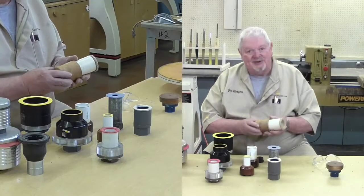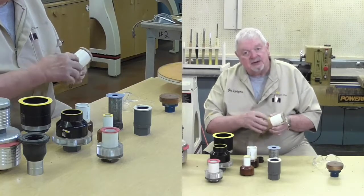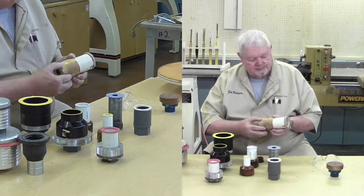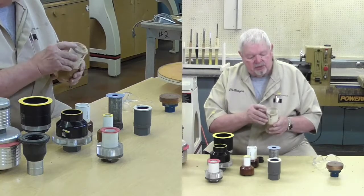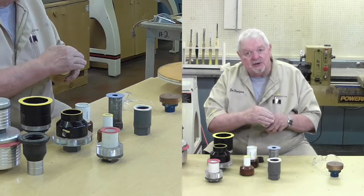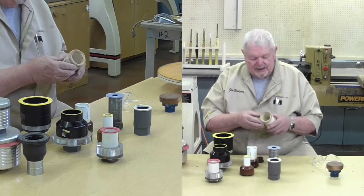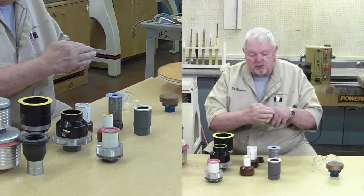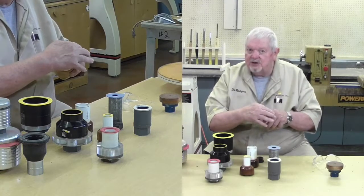Here's a poor example I want to show you. First of all, this is three layers of wood glued up — it's going to be porous and air is going to leak through the pores; this needed to have been sealed. The piece of pipe has been stuffed in and not sealed. Third, and maybe most important, is this foam seal. While it conforms nicely to irregular shaped objects like a warped green bowl, foam or wetsuit material that is too thick and too spongy will not hold a product solidly in place — it's going to tend to wobble. So I avoid this kind of foam.